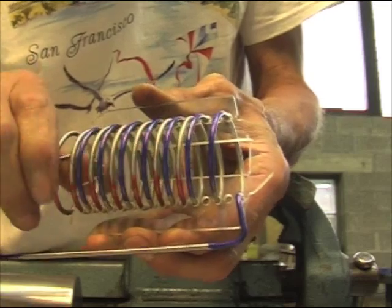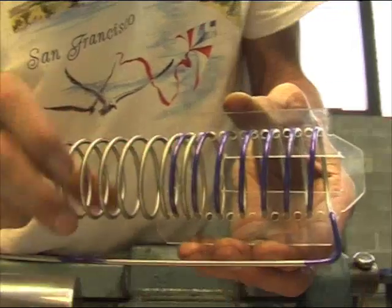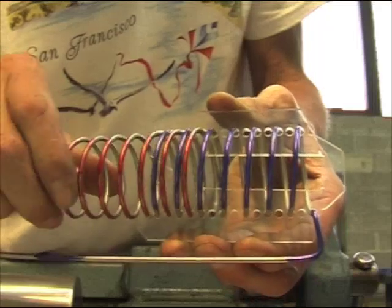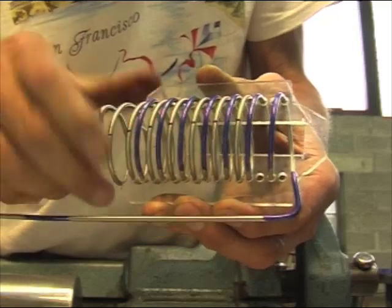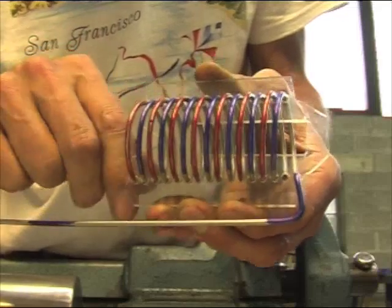See, it winds out and here you have the two coils. And this is why you actually have to be very precise when you prepare the spiral and when you drill the holes, so that you will have an easy setup when you do this.